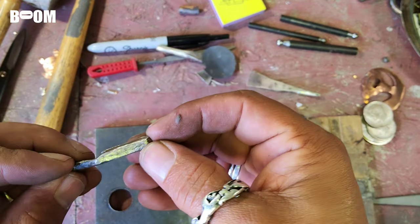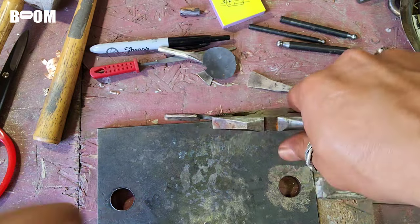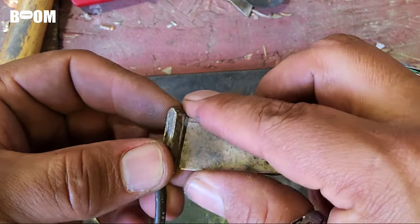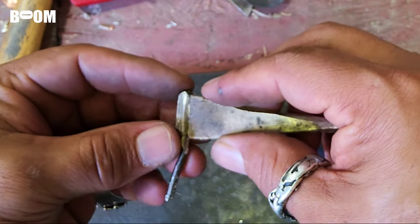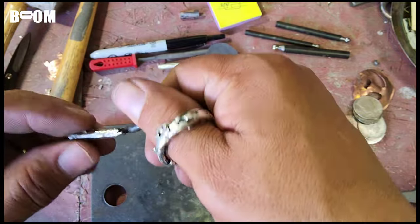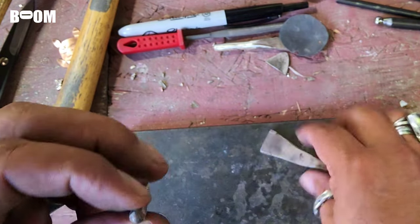Alright, look at that — it's kind of squarish now. I did hit it with my hammer to flatten it because it was starting to warp a little bit. I like having this grip length so I can hold it with my pliers. I'm going to hit this until I get it nice and round, but I'm going to anneal it first. The tube around this hinge wire is going to be huge — a big centerpiece. The hinge is the middle piece, so we want to make it saucy, bold, strong — like a monster hinge. Then we'll do a nice tube for it.